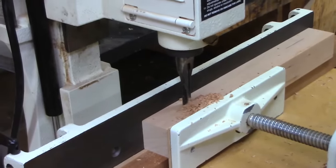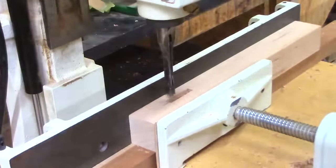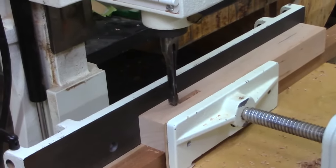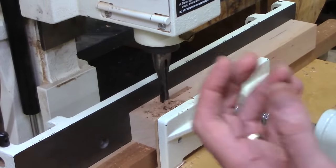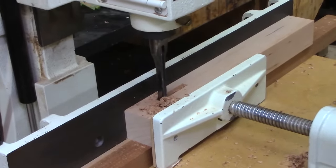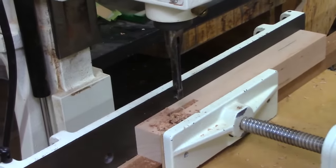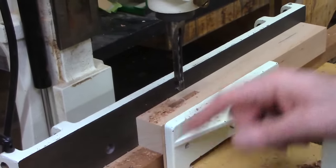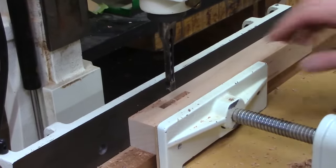Thomas asked what causes the squealing noise that comes from my mortiser, not idling, but cutting. Oh, it's probably you're getting binding chips in there. Sometimes it's the pitch or the sap in the wood, like cherry does that quite often. Or sometimes there's a roughness on the inside of your hollow chisel, so the chips go up and get bound in there. But I think it's more the pitchiness.